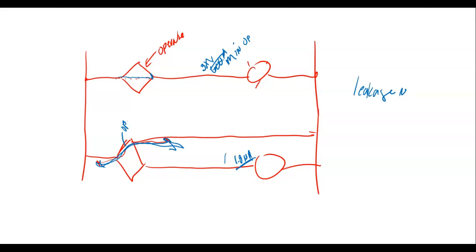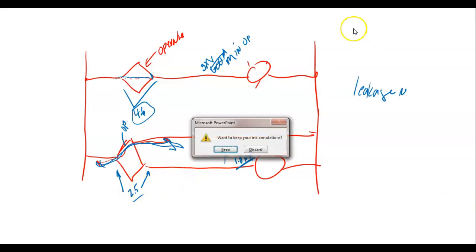So your 3-wire sensors, they drop less voltage. So up here, this guy dropped 4.6 because it's got to generate enough power to operate. This guy right here dropped 2.5. So these guys, we really got to be cognizant of how many we put in series, right? Because they drop almost 5 volts. This guy right here drops around 2.5. So in a 120 volt circuit, we could put a lot of these guys.